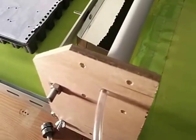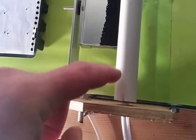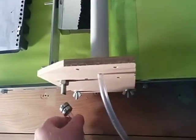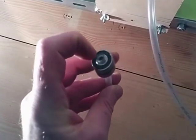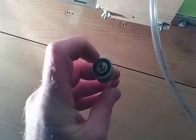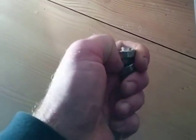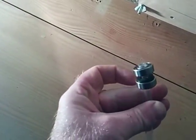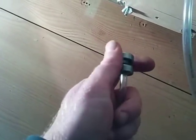On this end we've got a rubber tube that just goes straight into here with a couple of bearings there. To get the air seal, one bearing is not enough. Normally air will come through between the middle ring and the black part. So here I've got a standard washer that's a little bit smaller than the outer ring between the two, and that makes a nice air seal on this end.